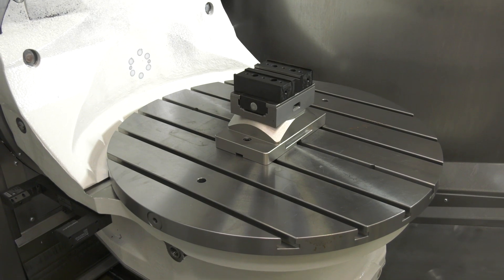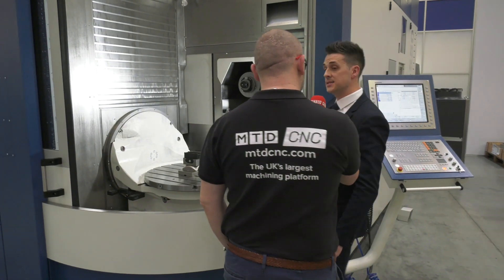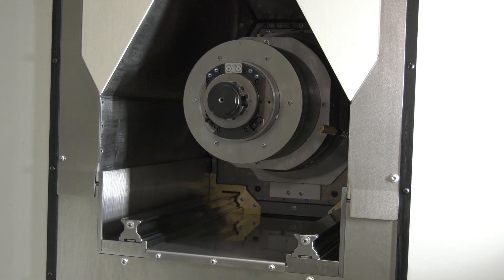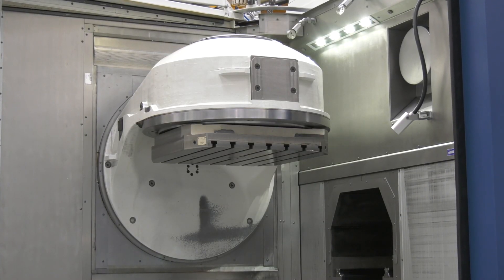Fundamentally you machine components differently to most of your competition — so what makes you different? Purely the concept due to the Z-axis: the Z-axis goes down a tunnel, so it's a horizontal five-axis machining centre. With the A-axis doing the full 230 degrees, you can do overhead machining — plus 230 and minus 45 degrees.